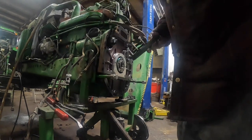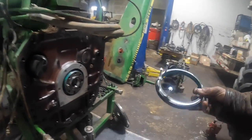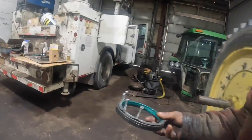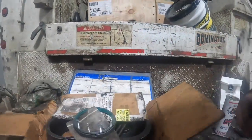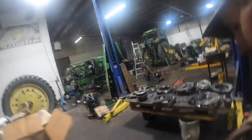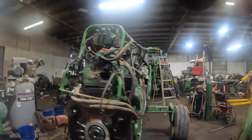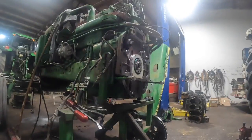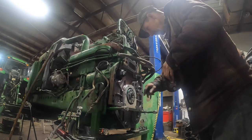Yeah, I think I had an 1/8 inch bit. These are out of my Cummins kit, actually. So those out of my ISX kit. So we got to get some emery cloth and clean up that green shit. And I just drilled 4 holes. Those don't come out too bad. Those ISXs, yeah, you can't get away with doing four holes in it. You gotta go all the way around that thing.